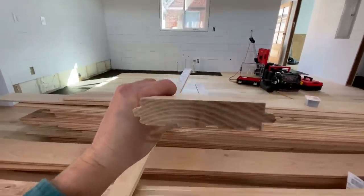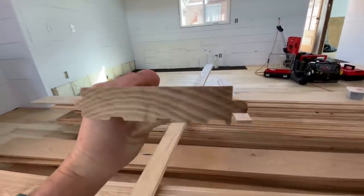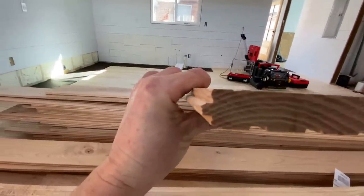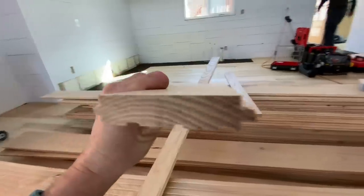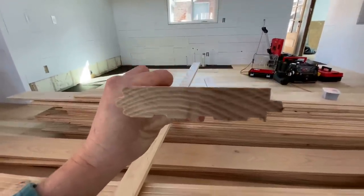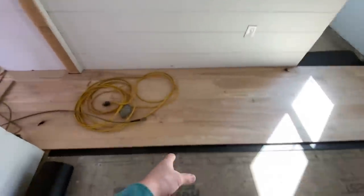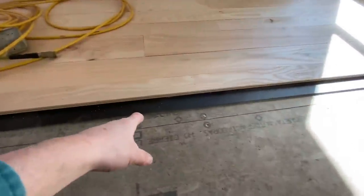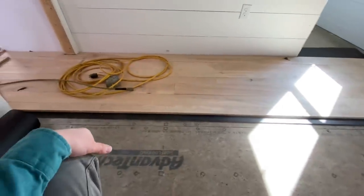I want to show this piece of wood that I modified. I took it home and cut the groove side off - there's the factory tongue side. What I did is I duplicated it except my edge is square, so I have a double-tongued board. That allows me to make what I call a reverse strip. We ran this wood in here from the living room, and right here I've got the groove side, so I need the tongue to go in that and then stick out a tongue this way - a nice little reverse strip.